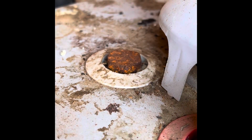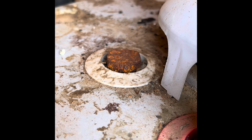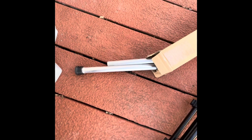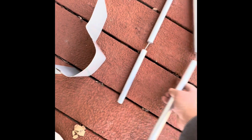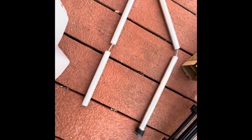Let's get into it. Okay, so this little rusted cap right here, this is the top of the anode rod, and then the rod hangs down from it into the tank, and this is the part that we needed to remove. We did order one off of Amazon, and again, I'll link that in the description. It comes pretty long, but you can cut it, at the little spaces in between there, to fit the specific size of your tank.